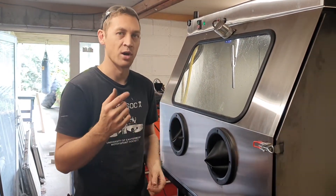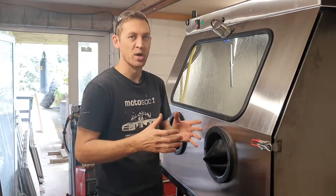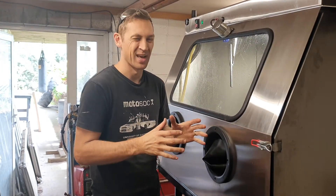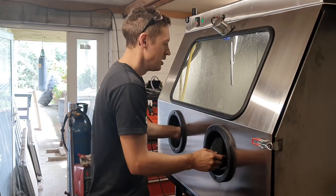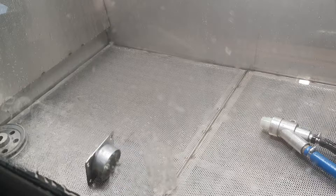One of the things I quite often tell people is to check it at the nozzle. You want to be 10 to 20 percent — I'll run as high as 50 percent — but most cabinets 10 percent will be enough; I like to aim around 20 percent. Disconnect your air so you've got just your pump running, get the water running out of your gun, and then use a clear jar to run the water in from your nozzle without air until it's full.